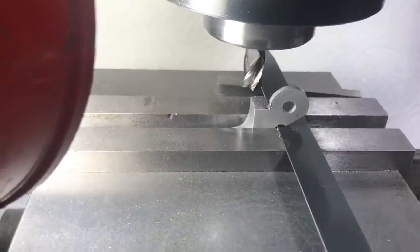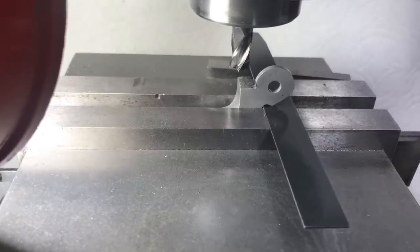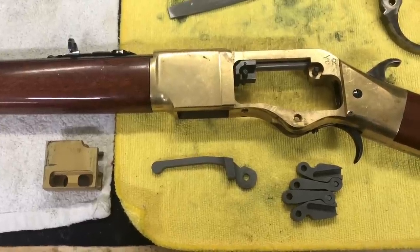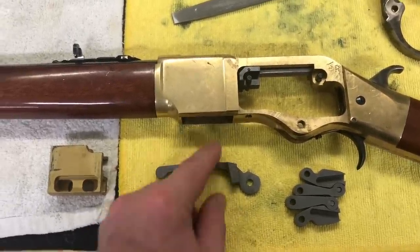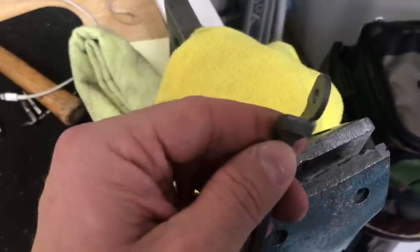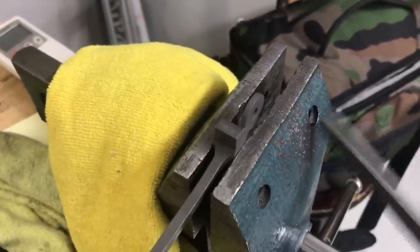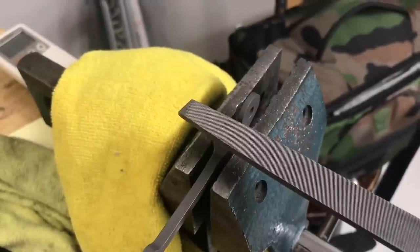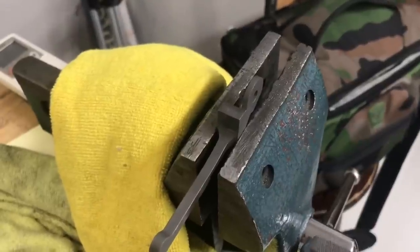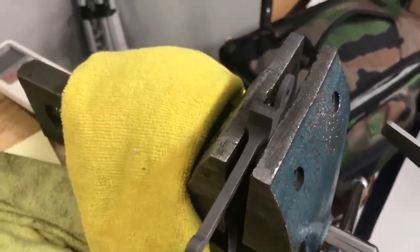The cutting process itself is pretty self-explanatory. You want to take off ten thousandths of an inch at a time, go back, and try it for proper installation — back and forth like that. We've taken our first ten thousandths of an inch off the under portion of the lifter arm. We have had numerous customers tell us they were able to properly install it perfectly without over-timing the kit using just a bench vise and hand file. That leads to one very important issue I'll be discussing in just a moment.